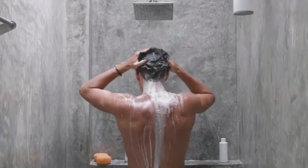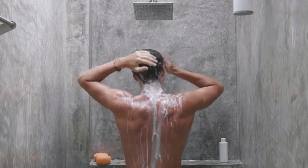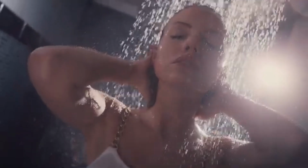In addition to the protection function, the PRV helps to avoid pressure fluctuations in the water supply network. For example, when you take a shower, the PRV stabilizes the water flow and you will not have problem with constantly adjusting the balance of cold and hot water. It can also reduce water consumption in general.